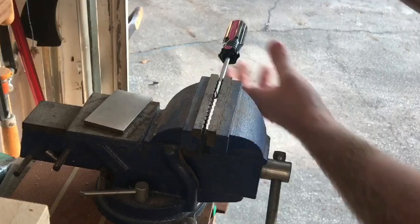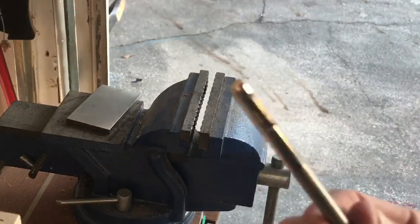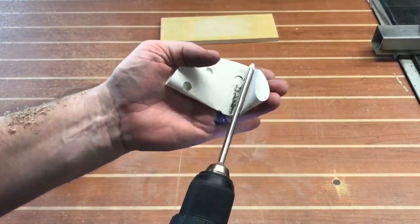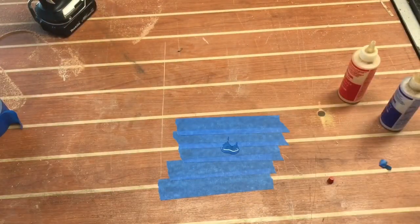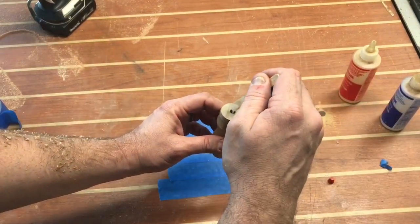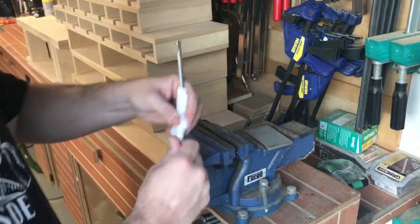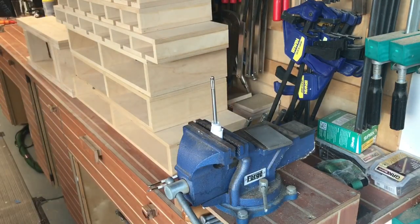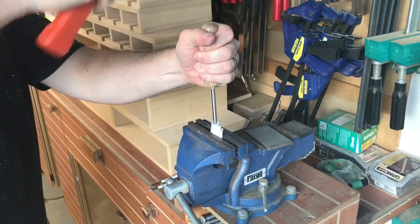Take the screwdriver from the big box store, install it into a vise, and about 20 swings of a hammer and that plastic piece comes right off. To give the metal a matte finish and clean it up, install it into a drill and spin it onto some 180 grit sandpaper. I mix up some two-part epoxy — this is the method of choice when you want to put a tool to a handle; it works really well and I've never had one separate using it. At the vise, I take the screwdriver shaft, clamp it up in some old rags so I don't mar the surface, take that freshly epoxied handle, and install it using a dead blow. A mallet would work too.